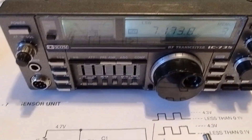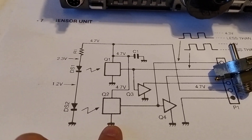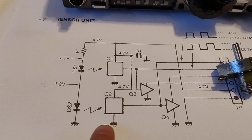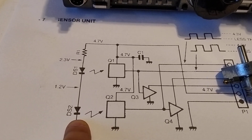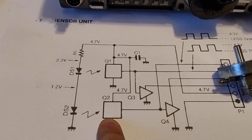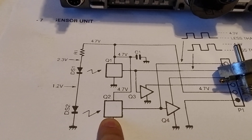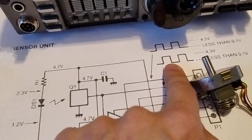The reason for this is that the encoder phototransistors are blinded by these infrared LEDs. Too much light is coming into the phototransistor and it's not giving the correct signal.